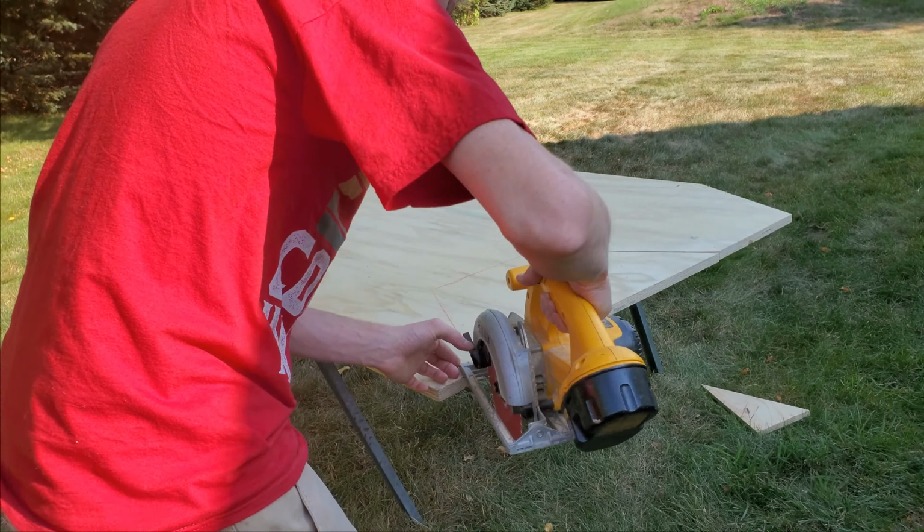With the fence bolted down and the trim piece and transom having dried overnight, we're going to go back the next morning, and we've got to mount all the furniture down. Now I'm using a large head deck screw that's going to go right through the furniture, right into that plywood below. I wasn't quite sure if this furniture was green treated or not. It looked like it was at one point. So I'm using coated screws, and that's important because the chemical waterproofing in that green treated plywood will eat right through your hardware if you don't use the right kind.